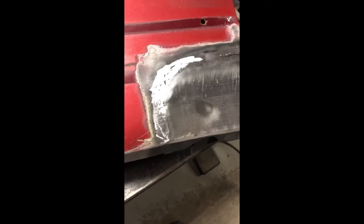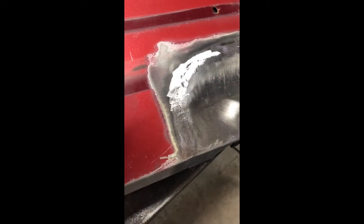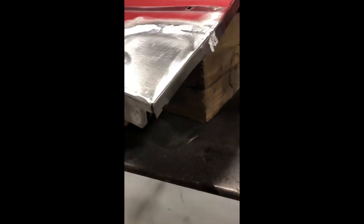We're back. I'll show you now where we're at with this rust repair panel. We've got it TIG'd in. Now we just have to do a little dressing — clean up the welds and it'll be ready to go to the body shop side. You can see most of the welds are dressed and cleaned up. The nice thing when you TIG is a lot of this was just fused together, and the weld from the TIG welder is a lot softer.